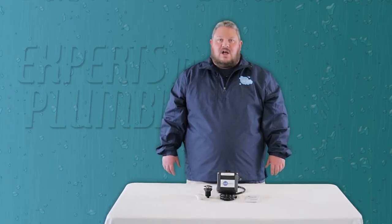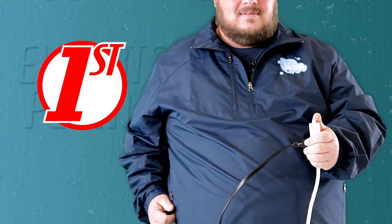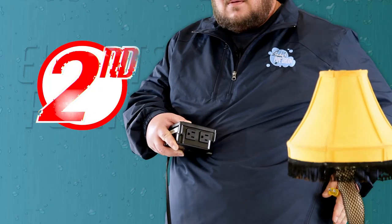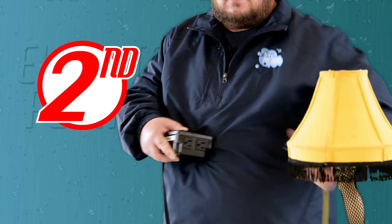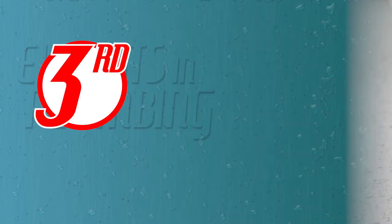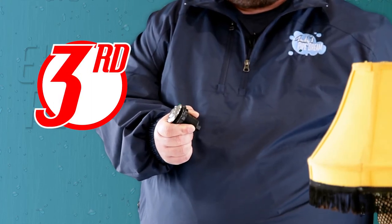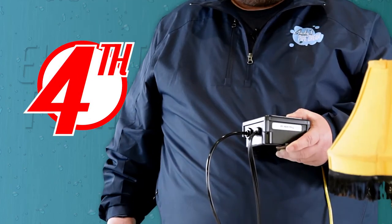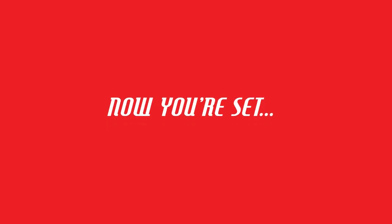So how does an air switch work? It's a pretty straightforward concept. First, plug your garbage disposal into an existing under-sink outlet. Hopefully, at a minimum, your island has an outlet — if not, you will need to add one. Second, plug your disposal into the air switch. Third, mount the push-button air switch into an opening in your countertop or sink surround and connect. And finally, connect the small clear hose to the air switch control unit. Now you're set.